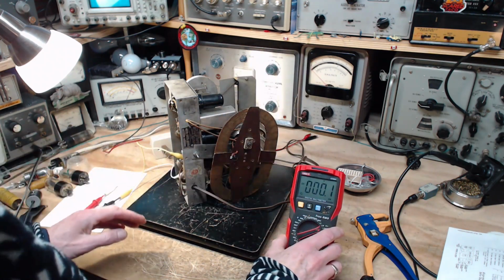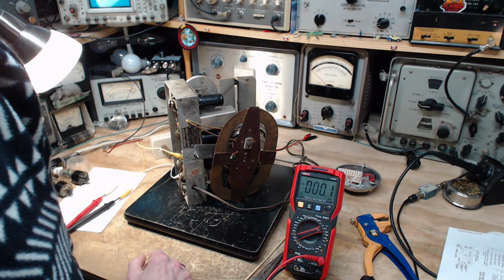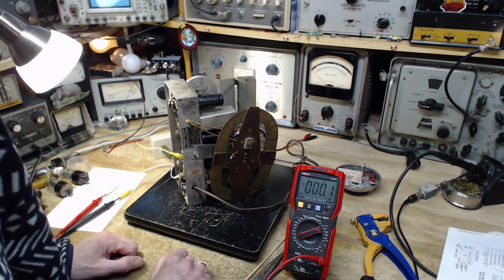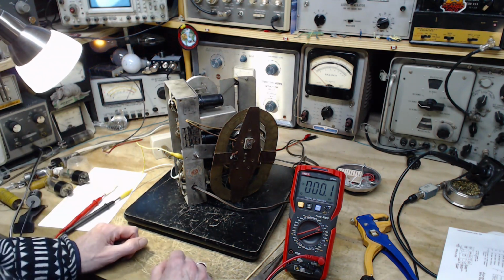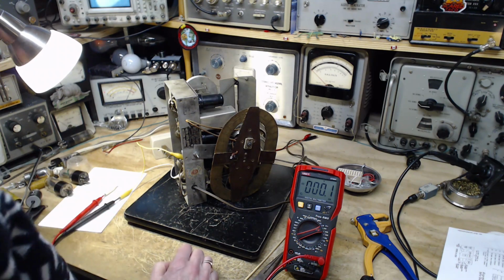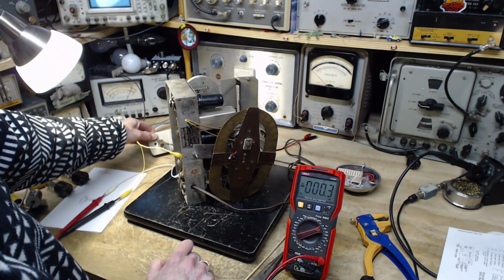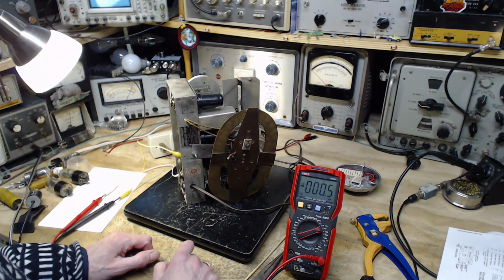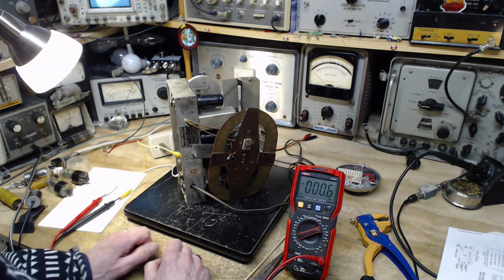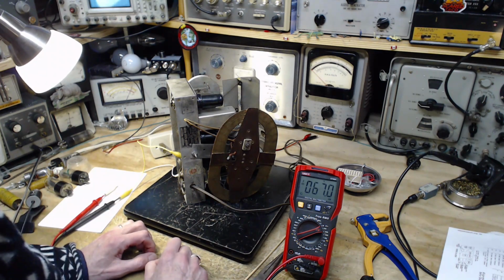So we're going to turn the radio on. We're going to find out if it still produces the proper B+. Okay, I think we can just switch it right on. Let her rip. Now, I do have the dim bulb engaged. I'll get rid of it in a moment. Yeah, everything looks fine. So we're supplying the radio with 114 volts, and they are good volts too. None of this shabby bad voltage. Good, fresh voltage, actually. The power station isn't that far from here. So, there we go.